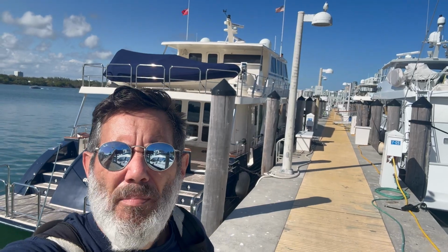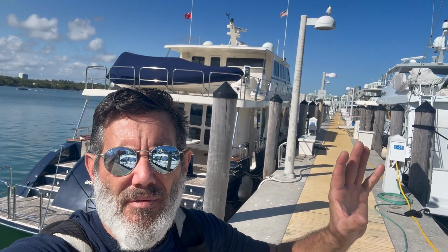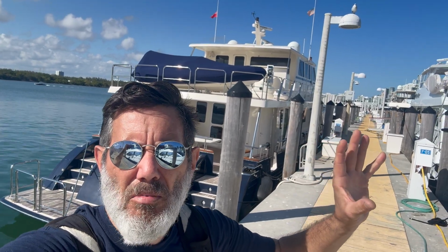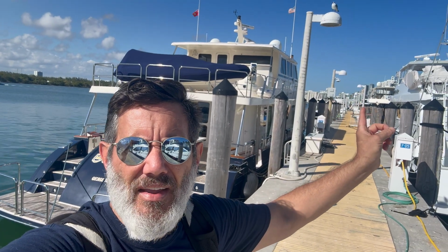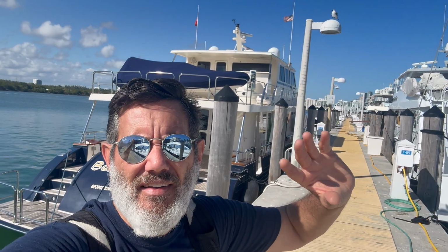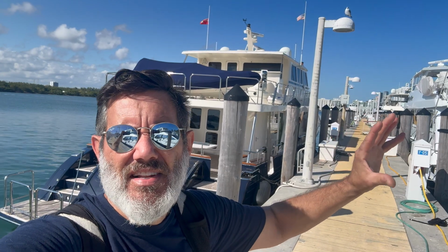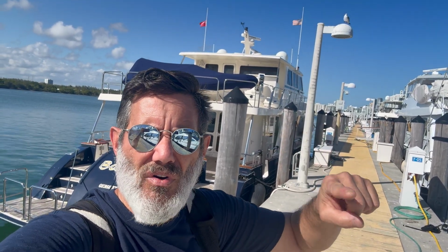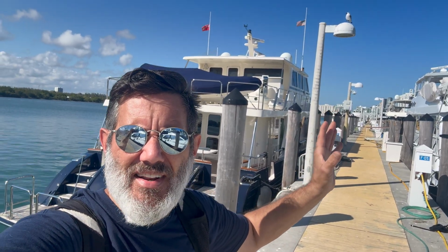All right, guys, it's a wrap on this boat. We updated his DeviceNet CAN bus circuit because we feel that there was a conflict or some sort of problem with the communication from the processor to the main control head, because it was daisy chained in a fashion that I didn't like. They ran short on one of the cables and they added an extension cable that wasn't compliant to our install. So what we ended up doing is updating the DeviceNet cable.